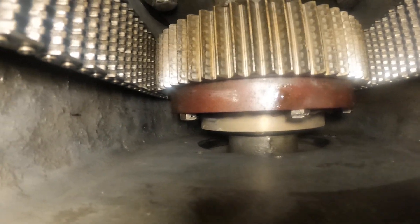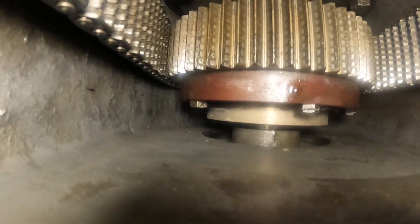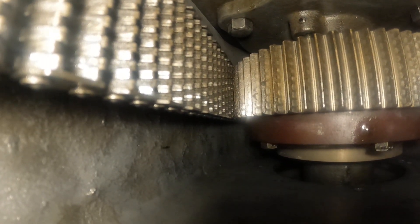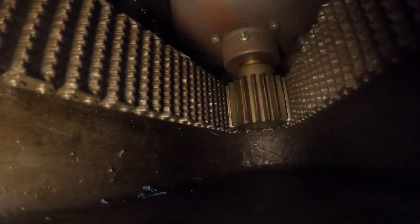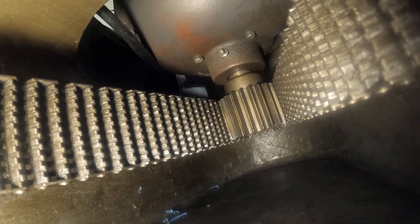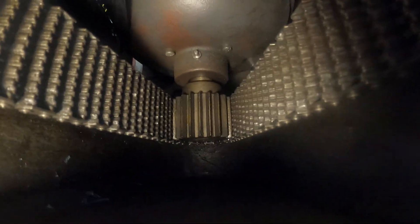The brake hooks up to this heavy outer cover as an anchor. You've got to be really careful not to turn the machine on if you don't have this back plate on it — you'll break the rod like I did. I have to machine it. But that's the upper hub. There's the sprocket off the motor. These chains are replaceable — you can still buy them. I think I priced it around 200 bucks. The chain probably weighs about 30 pounds. It's heavy — about 3 to 4 inches wide.